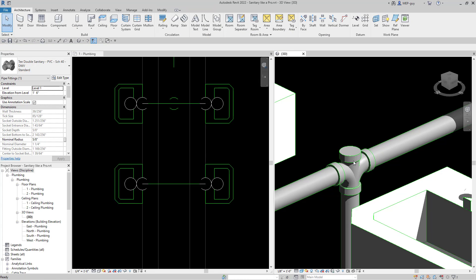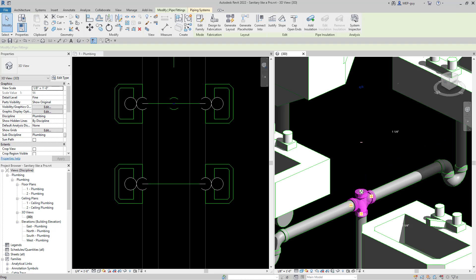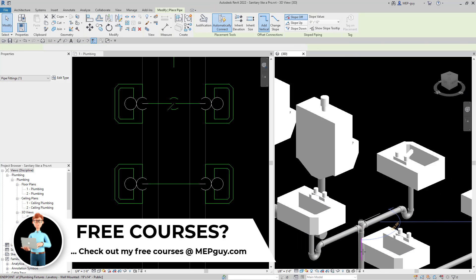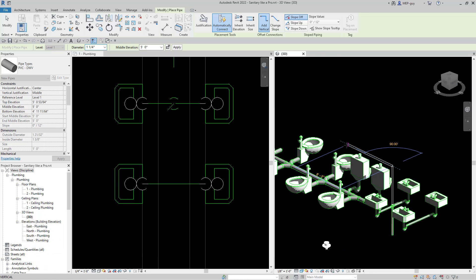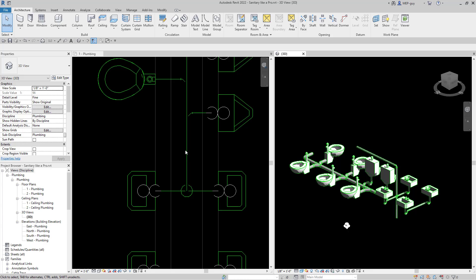We're going to click on that fitting, right click on this grip button, click draw pipe, and bring it up to maybe five feet. I'll start to draw it this way, holding shift to make sure it's drawing straight. Now we need to make sure that this piece is centered to this piece right here so that when we drop our vent down in this area it connects correctly. I'm going to temporarily move this by hitting left on my keyboard, and then align these pieces of pipe using the align button.